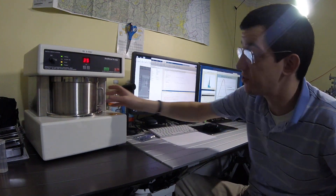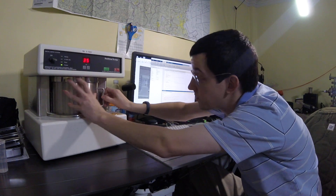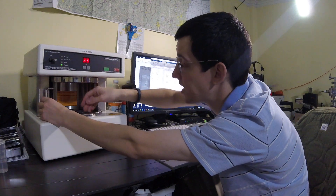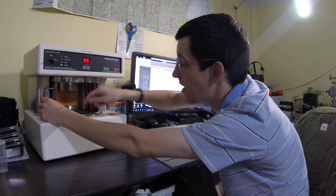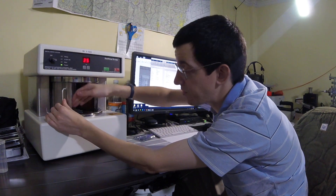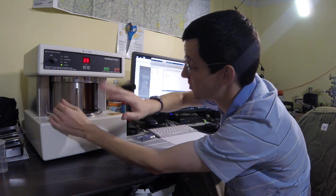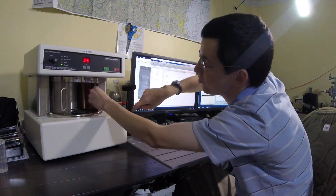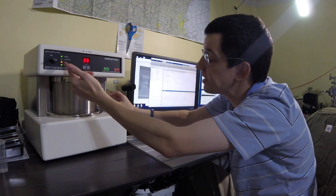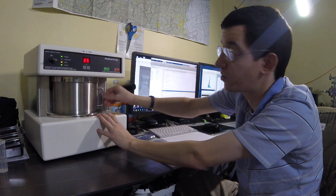That's some very good shielding on the cabinet unit. As you can see, great care has been taken: not only does it have a sliding closing door, it also has a re-entrant profile, so there is no possibility of direct X-ray scattering from the target plates out — because it would have to scatter several times before reaching the user. They also have re-entrant notches where the door closes, and a door interlock switch, so there is no way to actually engage the X-ray source while the door is open.